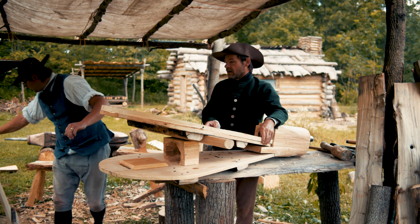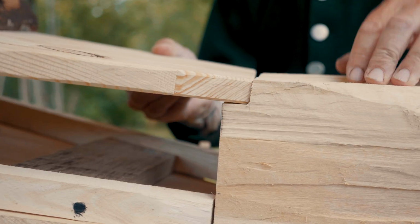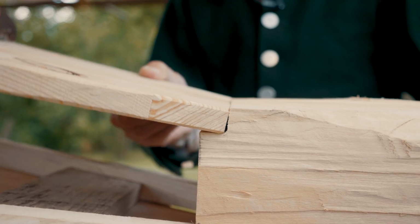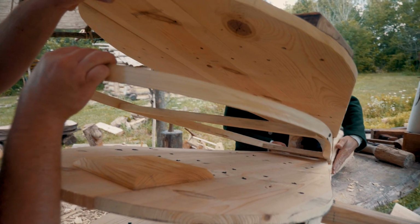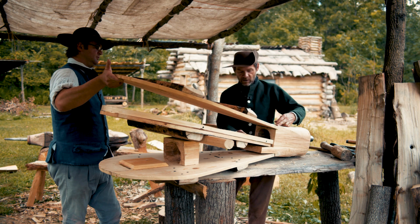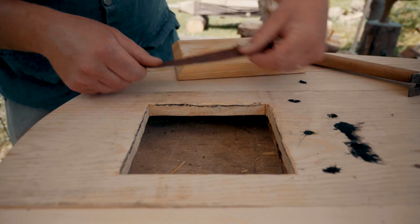And then we have our top plate, or our top level here, and that's going to set on this little rabbet notch. And there you go. That's what it's going to look like without the leather, so we can see what all the inner workings are. Now we just have to start putting these hinges together, fasten this one directly down to the nozzle block, and then we can start to put the leather around the outside.